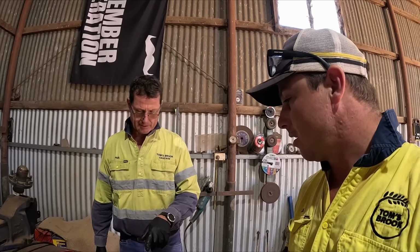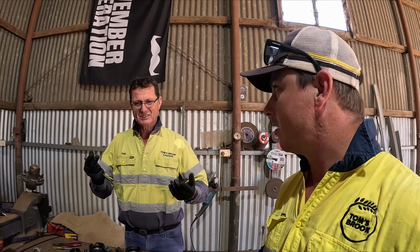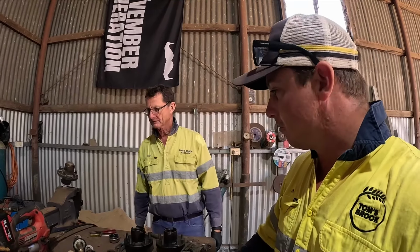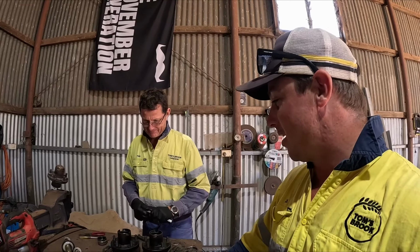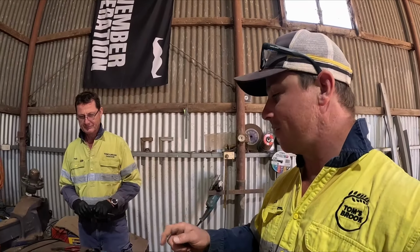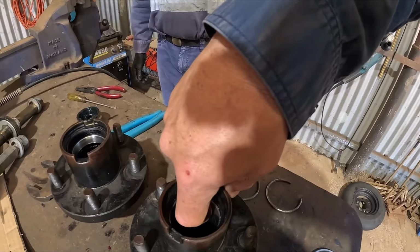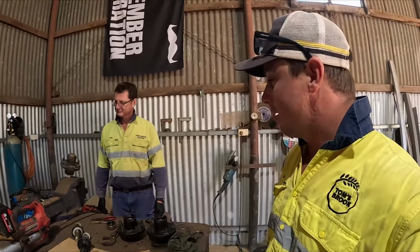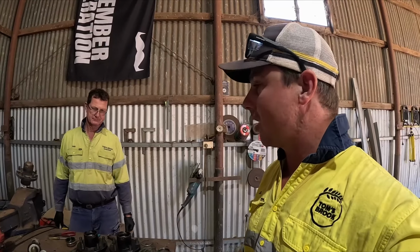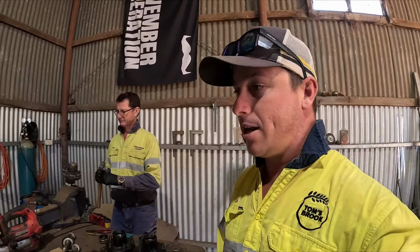Yeah, but these, I think it is just general wear because there's still a heap of grease in there. Dirty, but it's not covered in dirt and clag like we've had it last year. So I'll weld them because that helps shrink the cone, and it also gives Dad a purchase to hit off, because at the moment, not that you guys will be able to see in here, you can't get a punch in there to hit that out. So just to make life easier, you just do a nice hot weld and she can basically fall out from there. So I'll leave Dad to this.